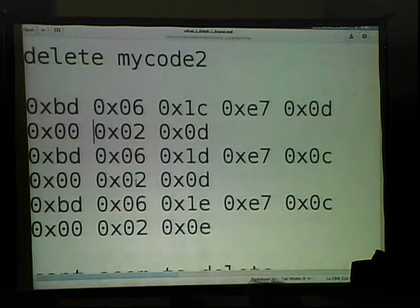That was a very funny thing I found. It only cares if it's the same sequence number. So the microcontroller was keeping track to say, did I already see this message? But only to that degree. So when I was doing my replay attacks, as long as I didn't send the same message repeated, so like if I sent the lock command, the door locked, and then I physically unlocked it. If I sent the lock command again, because it was the exact same message and there hadn't been any in between, it assumed it had already seen that message and had dropped it on the floor. And that's why I actually bothered with the sequence number, because you're right. Otherwise, it probably doesn't matter.